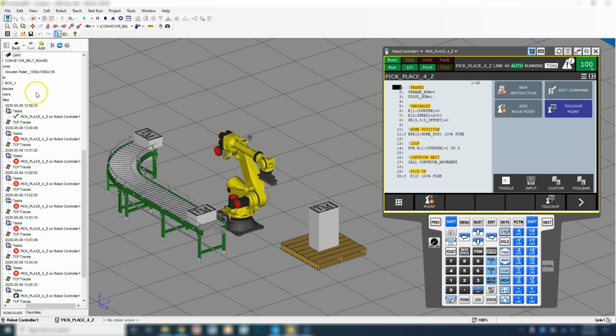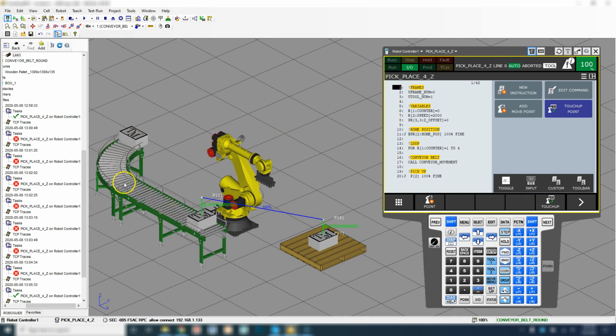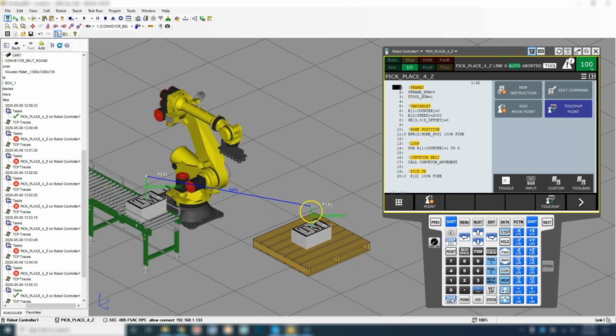And there we go. So again, it's not perfect, but it gets the point across with the movement. So we went through the movement of the conveyor belt, the pickup, the placement. We did a for loop to allow us to stack. In the next video, we will modify this program so that we could do a palletization of this box, maybe 3 by 3, and then maybe we'll add another stack to that.